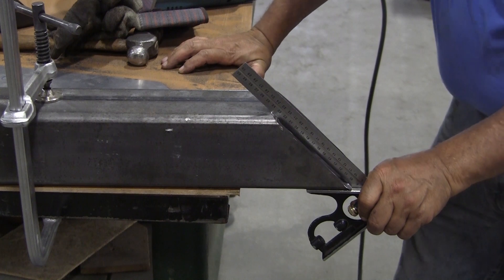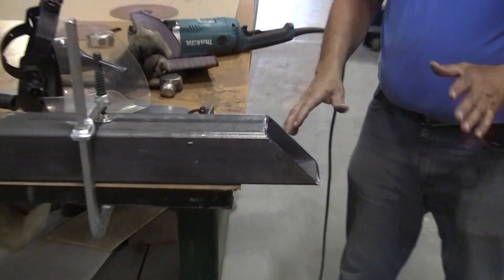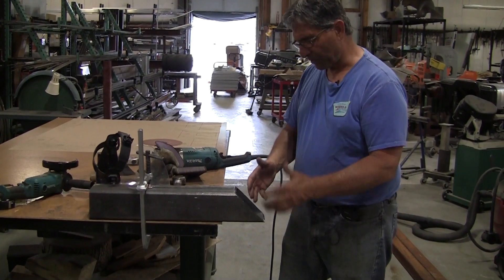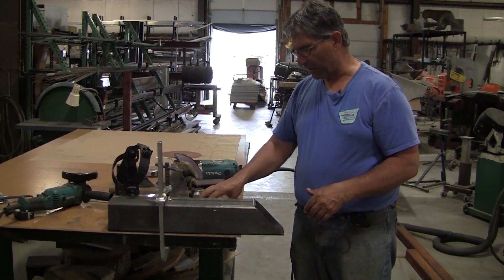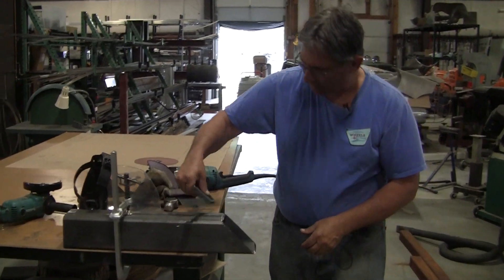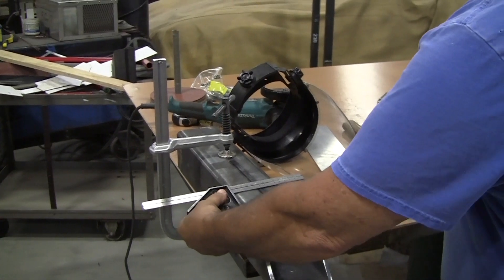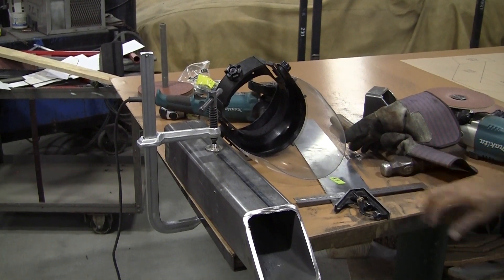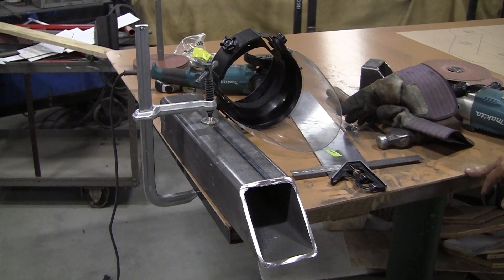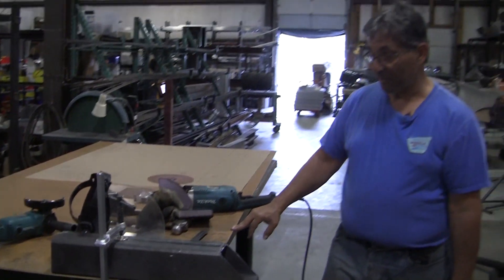Okay, that looks pretty close right there. One of the difficulties in cutting this is this stuff is not exactly square, so you kind of got to work around the curves and what not. You'll see that if you draw a line square here and here, it may not come out exactly alike. You kind of got to be careful with what you do. The nice thing about welding is it's easy to fill stuff in, for guys like me anyways.